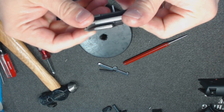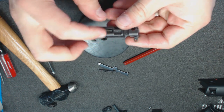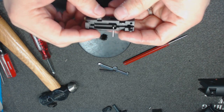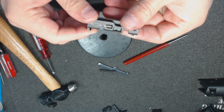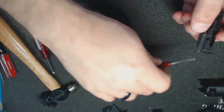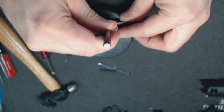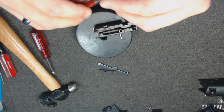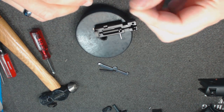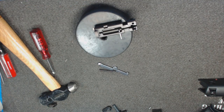And now the other piece in here. Oh, by the way, there's a wide end to this and a narrow end. Make sure you push it out towards the wide end. You don't want to drive the wide end through the body, and you'll just monkey things up. This pin is really small. If your punch is at all mangled, which mine is, it may be too wide to actually get in there. I usually have to refile down my punch when this happens, and I used to keep one filed down. I'm looking around for it. And maybe SOL. Let me grab a file real quick.